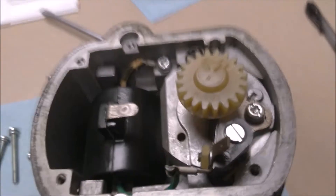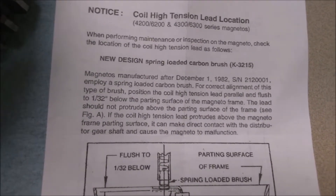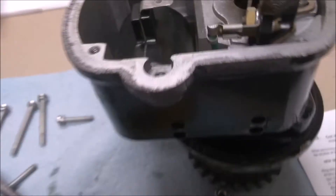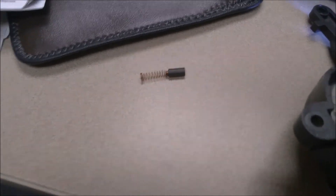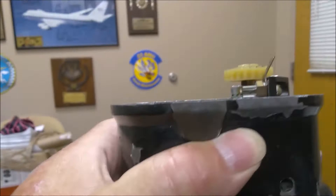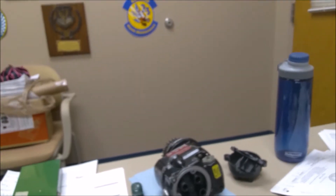The internal looks good. I'm going to go ahead and put my new parts on. It says for correct alignment of this type of brush, position the coil high tension lead parallel and flush to 1/32nd below the face. So we want that to be parallel or 1/32nd below, because the distributor lead has a spring so it can float and make contact on my coil. Let's just hold this up and see what it looks like - yes, I look flush. So that's taken care of.